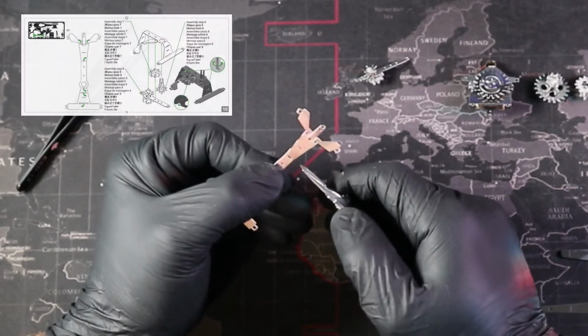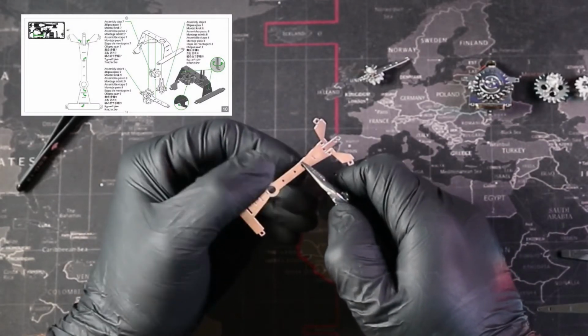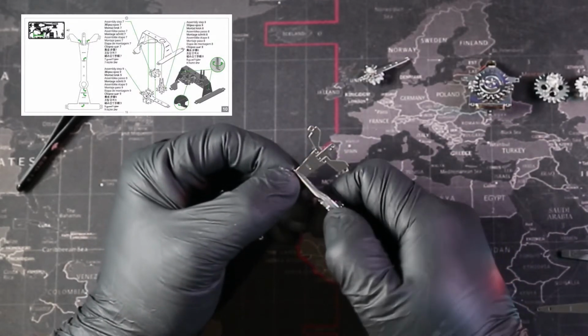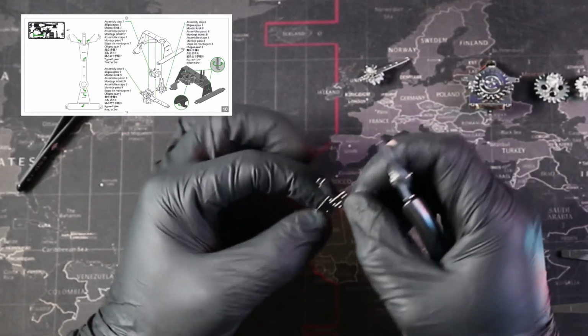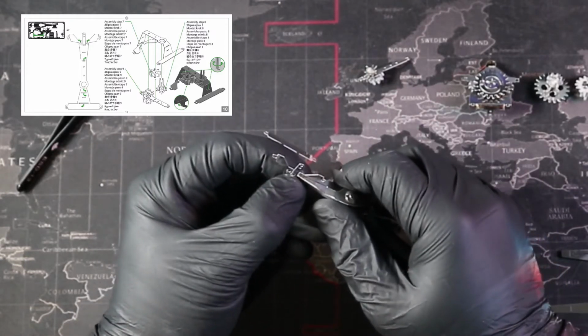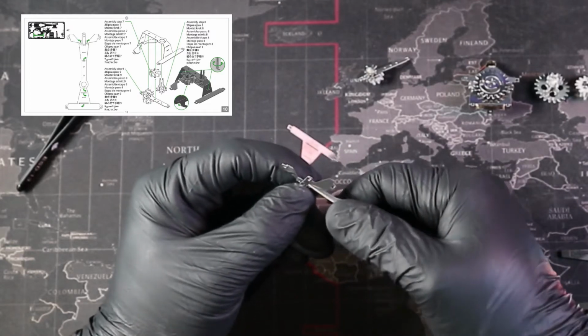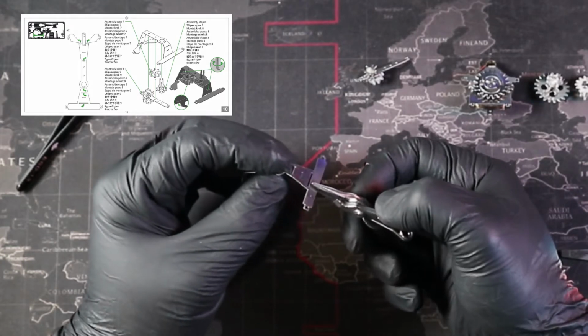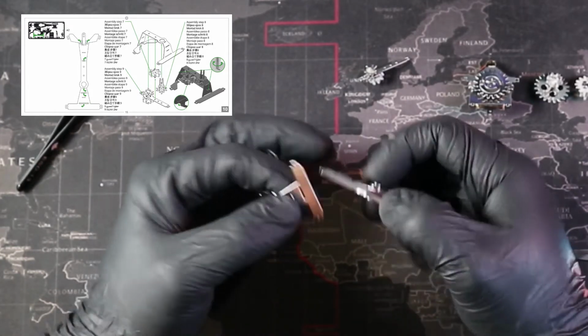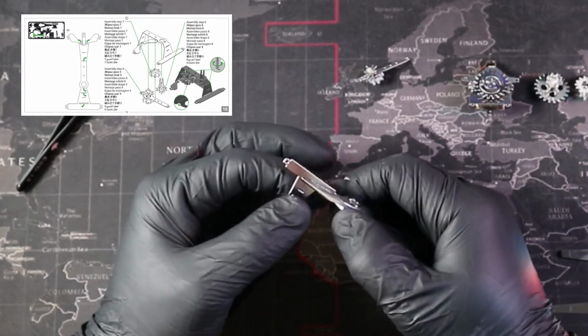The long X part here is super important to bend correctly. Some of our gears are going to be going inside of this part and they need to line up correctly. If we overbend one particular part of our X, we might run the risk of everything being slanted and our movement not working. Going right over to the spaces for our bends and using our picture as a guide, we can start to bend our part.